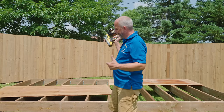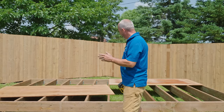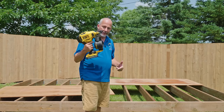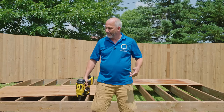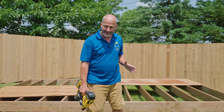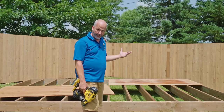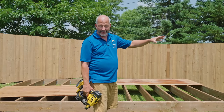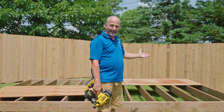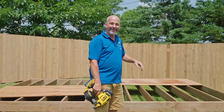We're going to put our subfloor on now — well, it's not even a subfloor, it's the floor. We're going half-inch pressure treated plywood, four by eight sheets. The system is we're installing the floor with nails — you can use a roofing nailer with inch and a quarter, or screws with your impact driver, same thing. It's a shed, not trying to be sexy on the inside, trying to be functional. We want something where we don't get any grass or weeds growing through it in the future — we've got a wild parsnip problem in our ditch and I don't want that growing up between my floorboards.